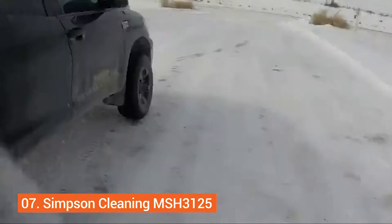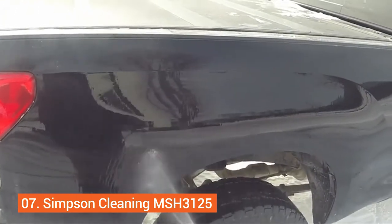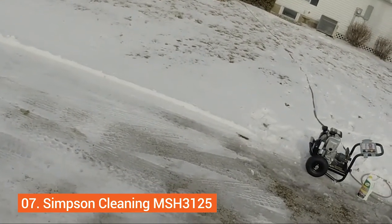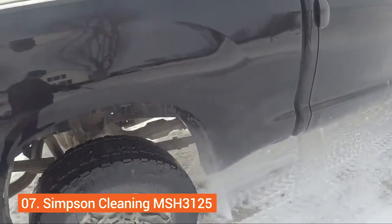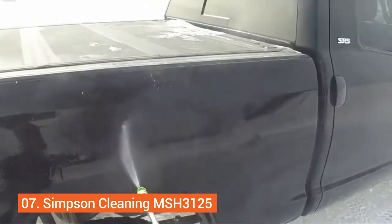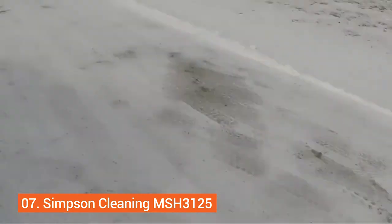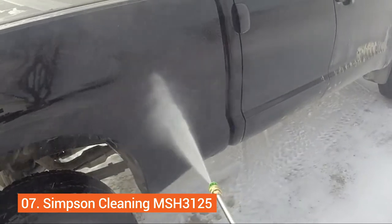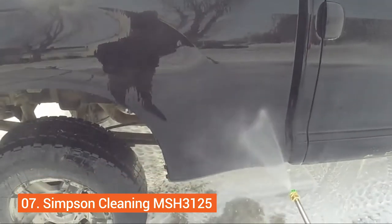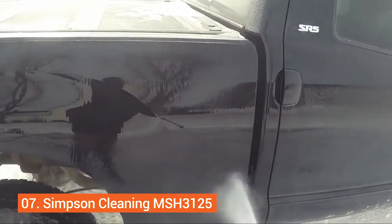And I believe I caught an air pocket there, because I didn't prime the system good enough, so bleed it off a little bit and hopefully it re-catches prime. This is definitely air in the line. I've seen this before. Usually all you can do is kind of just keep going until it picks back up on pressure. Getting back to pressure now. Yeah, I had a lot of air in the line. You got to make sure you bleed that out really good.